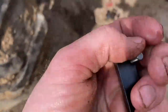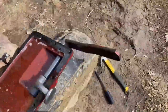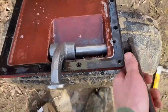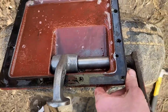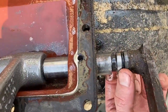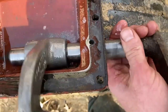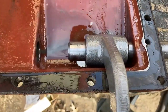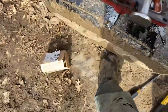Better keep those two together so I don't lose that little pin. Let's see if this shaft will slide now — she's going to come right out of there. There's a little O-ring that stops it from leaking, and you can see how this is going to go — it just slides right out. Then we'll pull this piece off the shaft and slide the new one on with the brake on it.